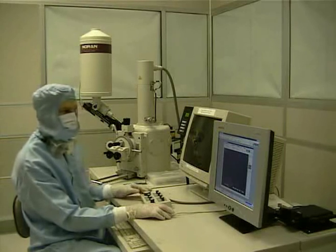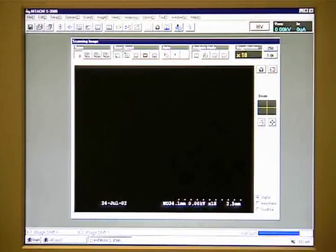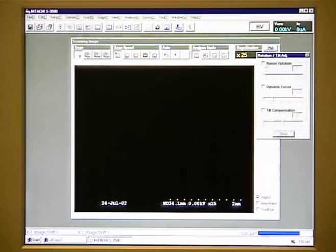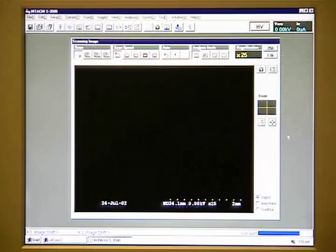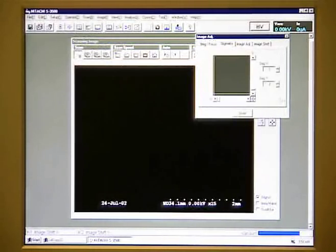Check the magnification and turn it to the minimum setting using the dial on the control box. These icons select our scan speed. We want to start in TV1. Go to Operate File and check what the rotation tilt settings are — make sure that Rotation Tilt Raster Rotation is off. Also check Image Adjust. If the stigmator setting is very far from the center, click the box in the corner and it will return to center. These are the best positions when beginning a scan.